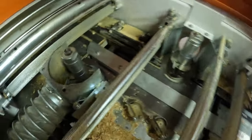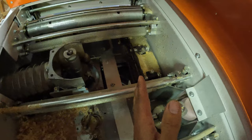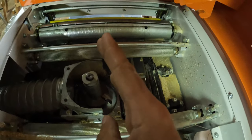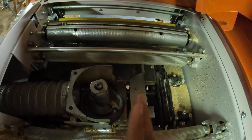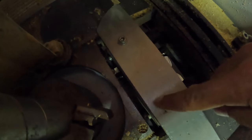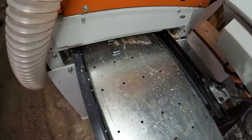An important part of this setup is you need to skew your fences. You'd think you want these fences going dead straight through the machine, but that's not the best way. If you offset the fences on a slight angle, when the workpiece moves through, those feed rolls are actually going to push against that fence and help hold your material. You don't want to be skewed the other way because everything will run away from your fence. I have this fence skewed ever so slightly.